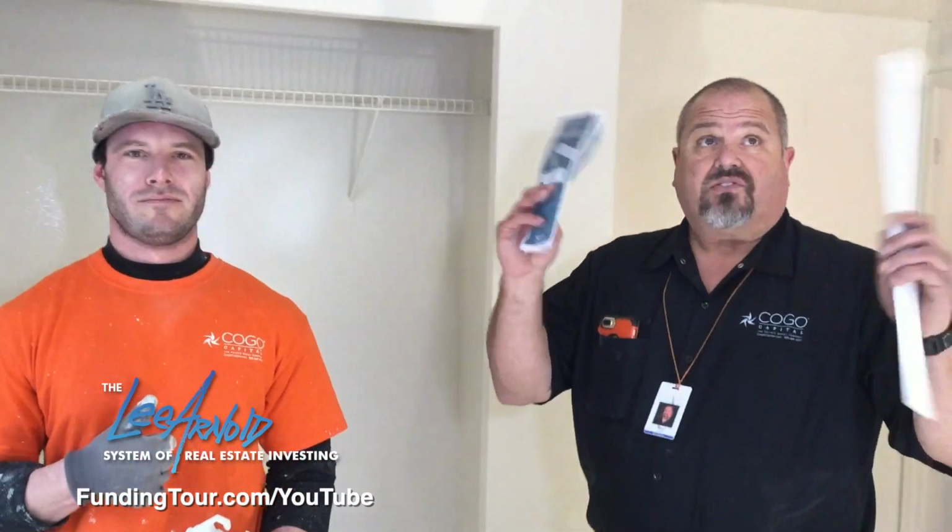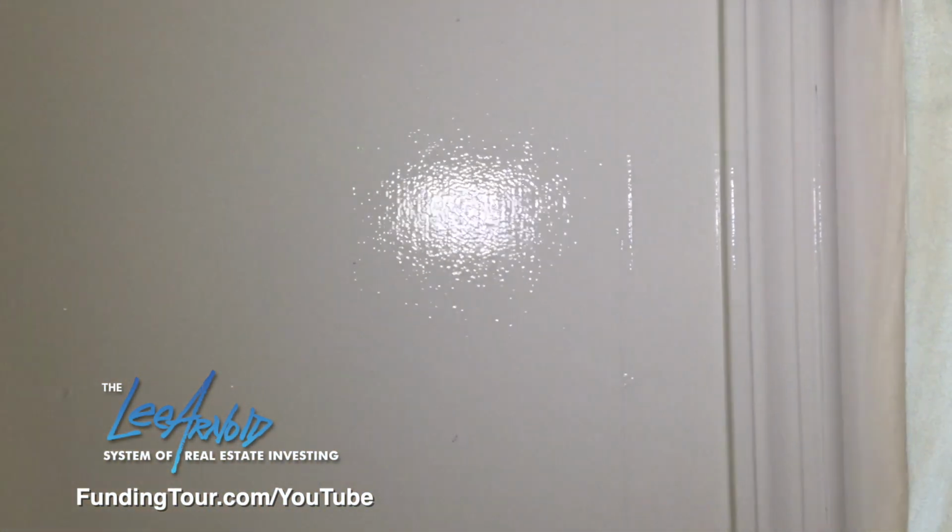Okay, now we've got the whole room painted, as you can scan around and look. One thing you do notice is that everything is painted the same color. We do that for two reasons. One is it's labor intensive to come back and repaint the ceiling white and do the trim white. And as you can look around there, we've put the trim up, so this room's going to have carpet. So we've already put the trim up and we've painted it.